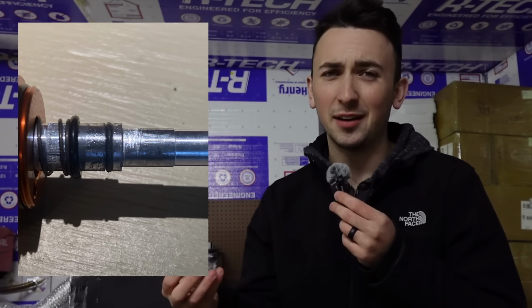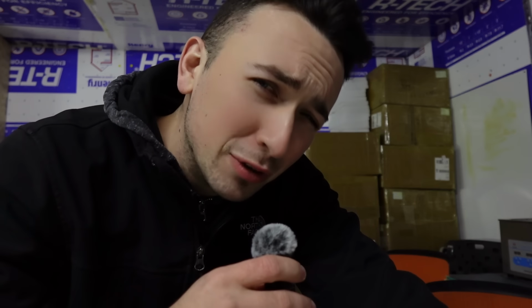This first round of beta testers found 2 main issues. The first one is that the aluminum nozzle was causing some extra friction and would slowly wear away with time. This was an easy fix. My early prototype nozzles were made with Delrin, and the only reason I was using aluminum nozzles was for cosmetic reasons. I thought the silver looked cool. That's not a good reason to have metal on metal contact. So fix number 1 is order nozzles made of low friction polymer instead of aluminum.